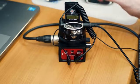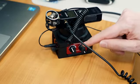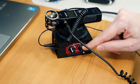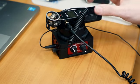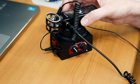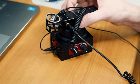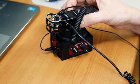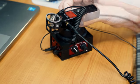But our trim pots over here, as you can see, the left side is occupied by the much hotter Sennheiser, so it's cranked way down, and the Radio Shack lav mic is turned all the way up because it's a much weaker microphone. I've actually got the Zoom here running full blast. It's at the full level it can possibly put out, and so I'm going to show you what I'm talking about here. You might notice the noise floor is rather high, but I'm going to turn it way down now, and as a result the microphones are going to fade here for a second.